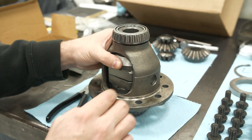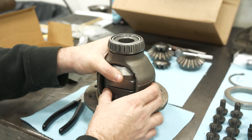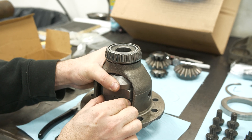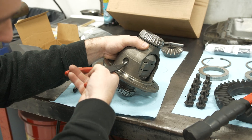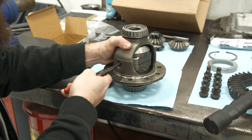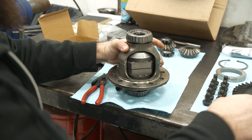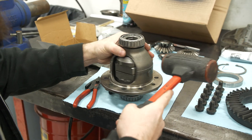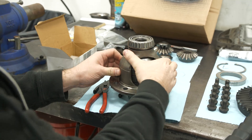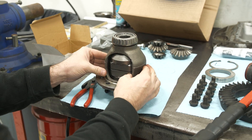This one side locked. The other can't go too far because of those pins, so this should be allowed to slide up and ratchet. After some reevaluation, if you take some snap ring pliers and open up this clip, you can then get this pin in and started. There we go — so now that's in. That's good.